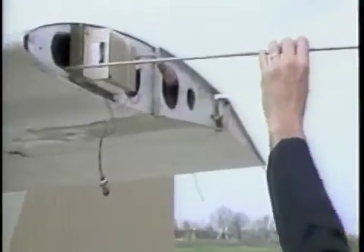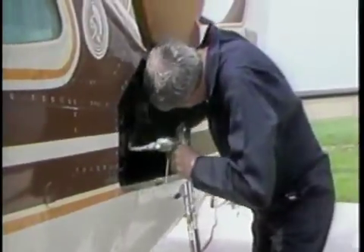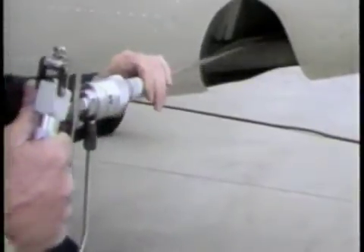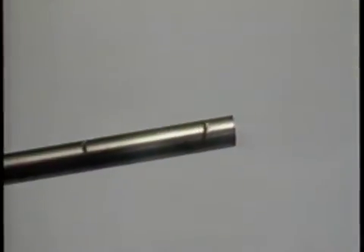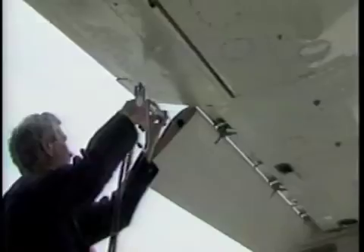Your Corrosion X system comes with various wands or rods. The larger diameter rods are to cover the larger span areas and the smaller for smaller access areas. The flexible wand is used to access areas where full rotation motion is required. The spray gun can be used by itself when the need arises. The rule of thumb in determining which device to use is finding the optimum balance between convenience and effectiveness. The 6-foot, 3/16-inch wand is specially designed with a directional curve and is ideal for treating control surfaces. You may also adjust the spray using the pin adjustment lever at the opposite end of the wand.